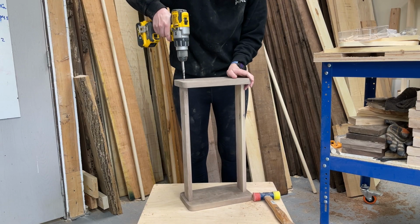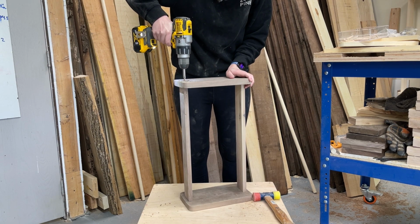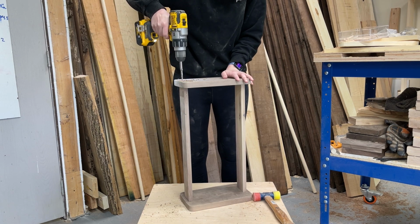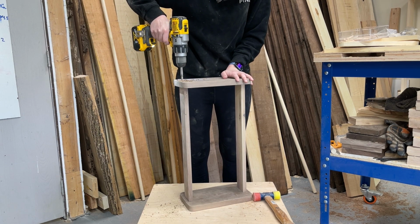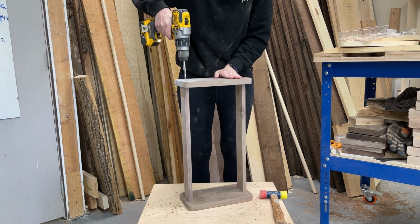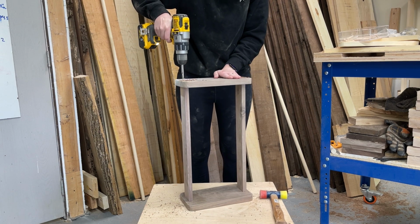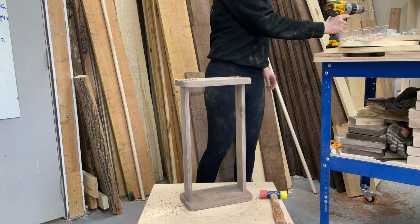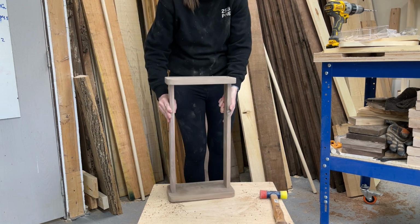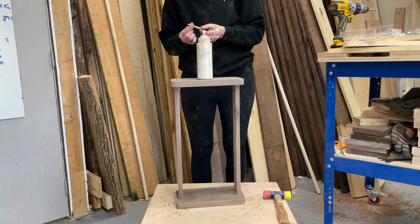The next step is drilling for your Miller dowels using your Miller dowel bit. Carefully drill straight into where we had already pre-drilled the holes. I prefer to wait 30 minutes to an hour for the glue to dry during the first assembly, and then to drill for the Miller dowel holes. Using your Miller dowel bit, you'll drill down into each leg once or twice depending on the leg style that you choose, up into the line on the Miller dowel bit.